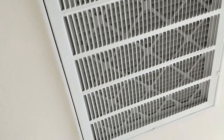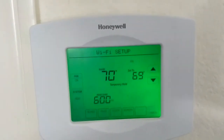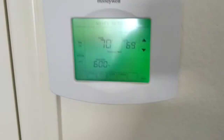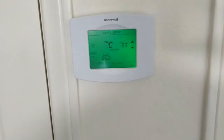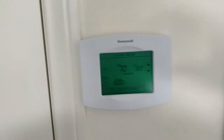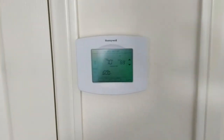We're talking — that's good. For Wi-Fi setup you have to download an app to your smartphone, iPad, or computer. The app will walk you through it — it'll hook into your home network and see this thermostat. The app is going to walk you through the rest. My purpose was to show you how to mount it and run a C wire if you don't have one. Hopefully you've got a spare wire on the wall like I did. Now my downstairs is wired for whenever I need to upgrade to a Nest or ecobee. If you have any questions, hit me up.